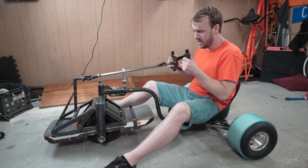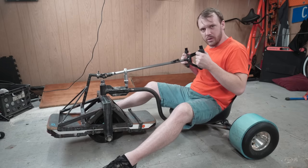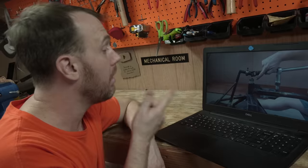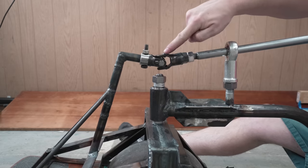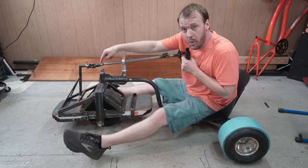I was beginning to feel more confident with how well this part was performing. But when I pulled back to right here, I'd lose all my steering. This was by far the most time-consuming part of the project. I was clueless until I realized that when the universal joint is over the pivot point, I lose all steering. I'm gonna make it so the universal joint never gets past this point.